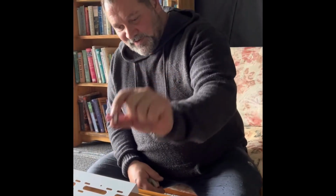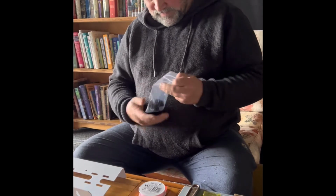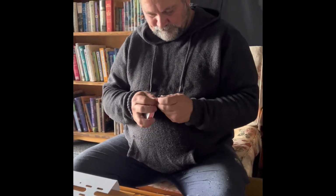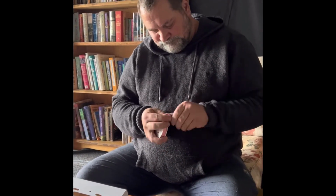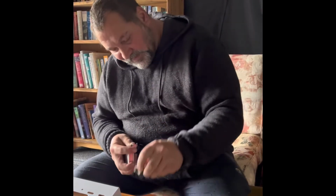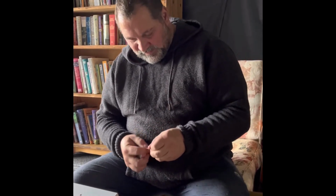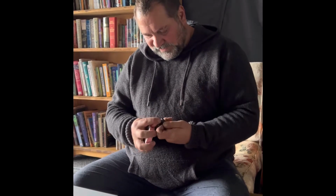Okay, that's the second joiner done. Now we've just got the two end pieces. So our water filtration treatment system is going to include the polypropylene and ceramic cartridges, as well as an activated carbon cartridge as well. So these joiner bits here don't have rubber seals on the end of them, so I'm just going to layer them up with a decent bit of thread tape just to make sure we don't get any leaks. Don't want to waste any water.